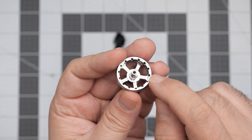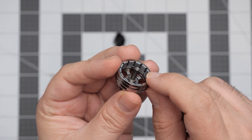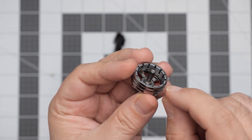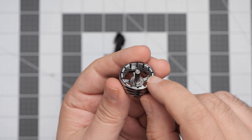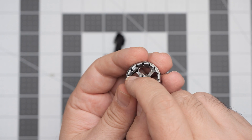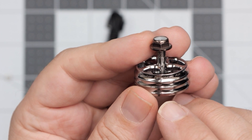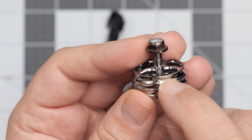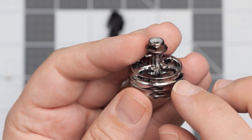Inside, of course, there is a place for 14 magnets, and if you look carefully there are specially manufactured extrusions from the bell that precisely position each magnet in place. The bell also appears to be dynamically balanced — you can see some epoxy glue that balances the bell so it doesn't vibrate. One strange choice: the motor name and size are marked with tiny, tiny laser-engraved letters, and if you don't know where to look, you might have trouble finding them.